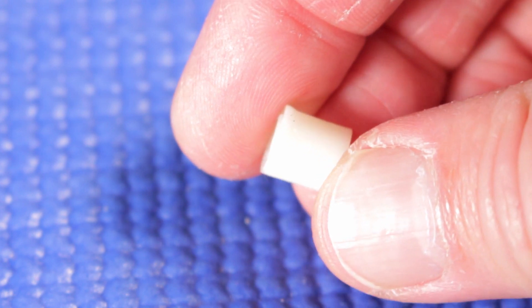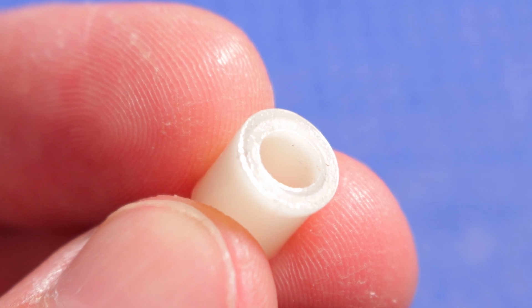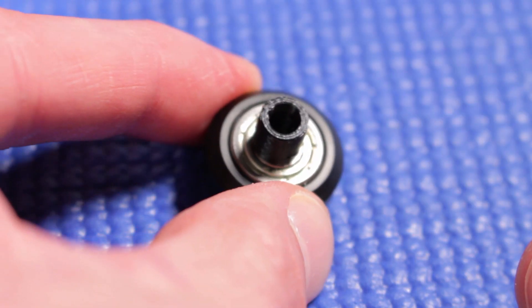While I'm replacing the wheels I'm also replacing the spacers. The original stock spacers are nylon and most of them have mushroomed at the ends and have indentations where they've been ground into the bearings. This might be due to what I'll call aggressive tightening. But regardless, it causes the spacers to spill out over the center race of the bearing and rub against the moving part. I don't know if that's detrimental to print quality, but adding any potential friction to a part that should be moving freely can't be good. My solution was to make spacers slightly smaller than the inner race of the bearing and be a little less aggressive on the tightening.